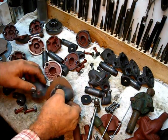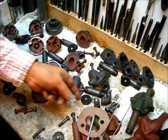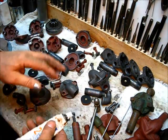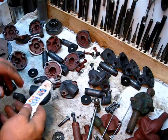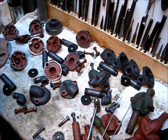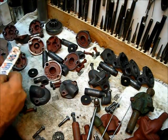Always use a gasket sealer on a gasket — don't get in the habit of putting gaskets on anything without some kind of sealer. I use Gasoila about 99 percent of the time, but for these little irregular gaskets I use Permatex — that old brown one. It's been around for years and it's good stuff. They have a Number One and a Number Two; one gets hard and one doesn't. Do your homework — you can get it at Walmart or your local parts store.